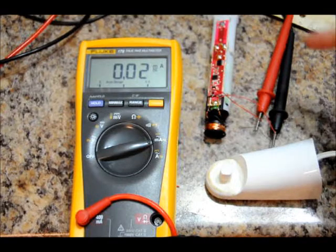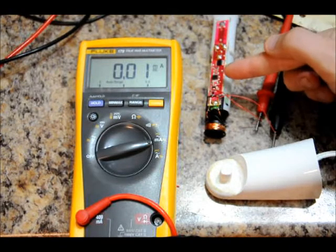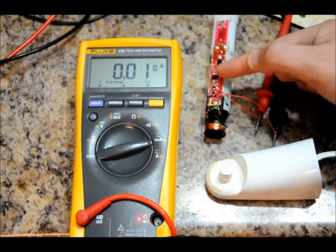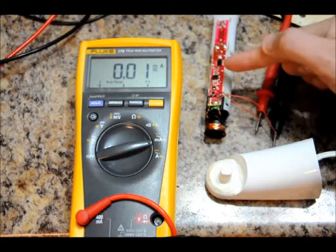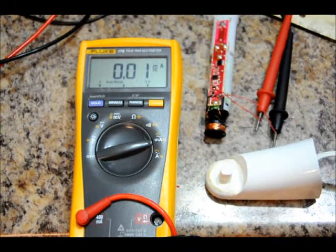Needless to say, this toothbrush is toast. I've disconnected the battery — I could reconnect it, but I've got no interest. I've damaged the bristle side, so right now it's just a learning tool. What I could do, if I had a Dremel and was very careful, is cut off half the board — including the microcontroller and the eight-pin FET IC that drives the motor — and use this receiver with this transmitter to power something small like a few LEDs or perhaps a low power motor.